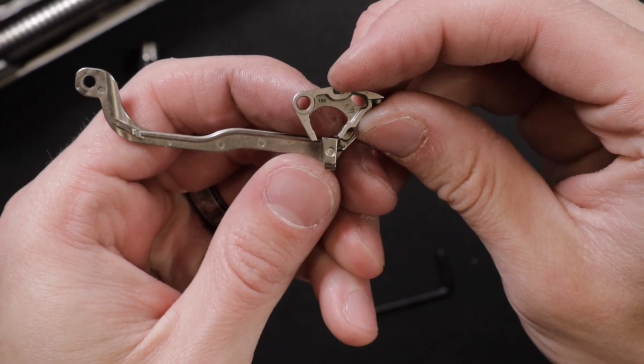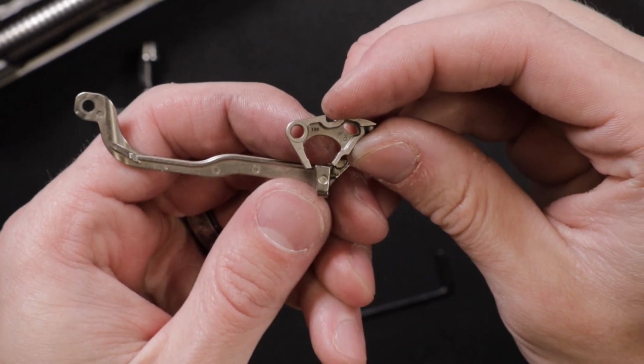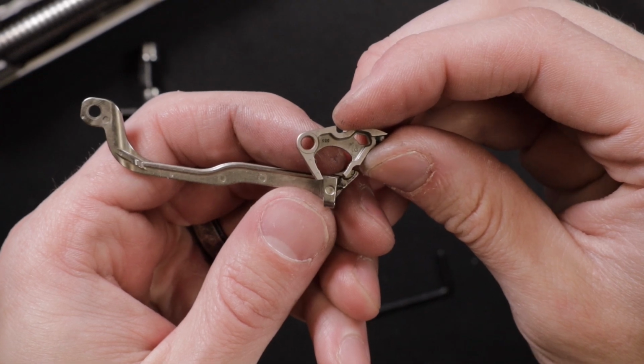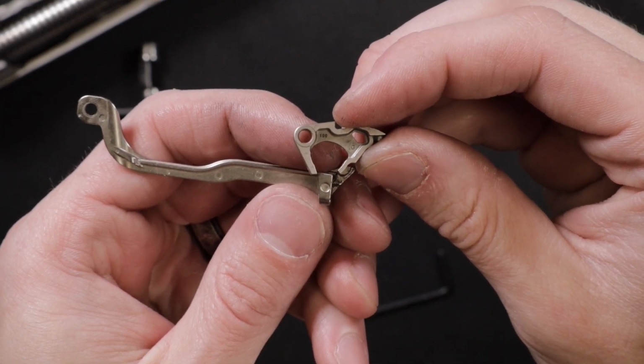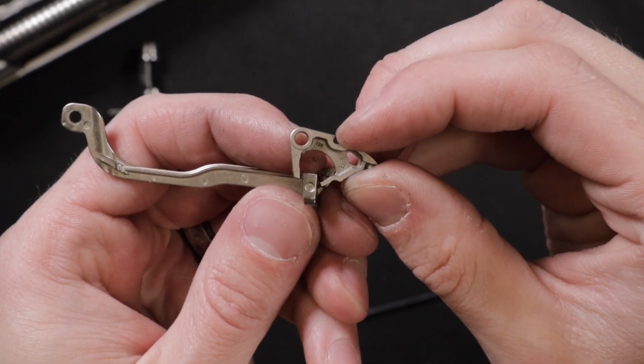It helps recover from partially pulled triggers, making sure the Sear resets completely. It increases resistance to accidental Sear movement, especially under recoil or impact. It's one of the key reasons the post-voluntary upgrade fire control unit is so robust.